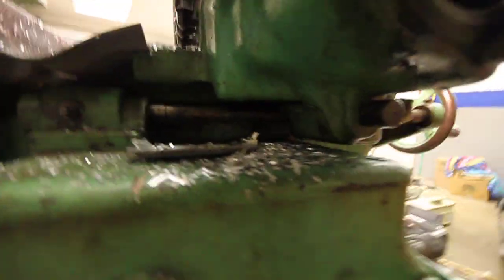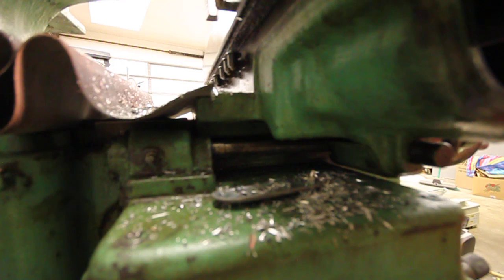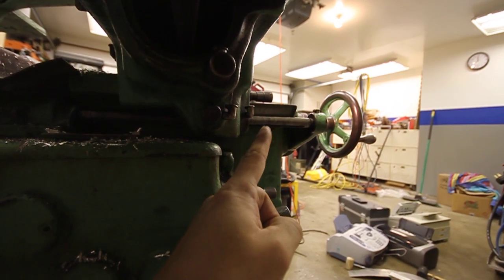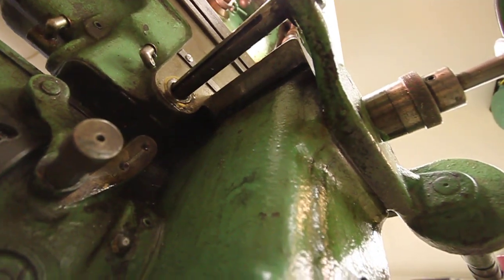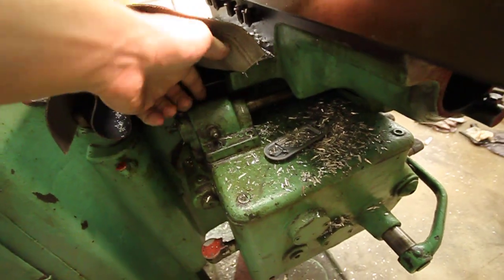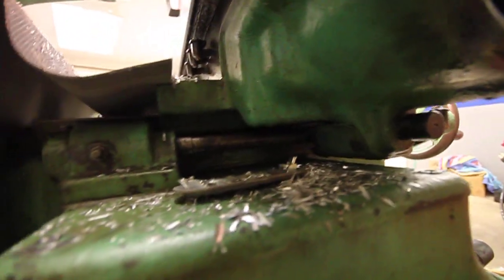For the Y-axis, I was thinking about mounting it down here. This is actually the power feed shaft that runs through here. There's a bit of room between the mill and the shaft that would allow me to run a small Chinese scale or something like that back there — if I'm imagining it correctly.